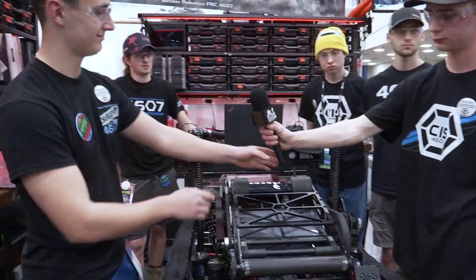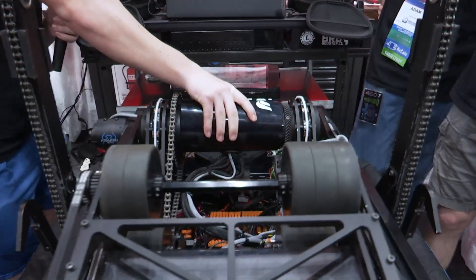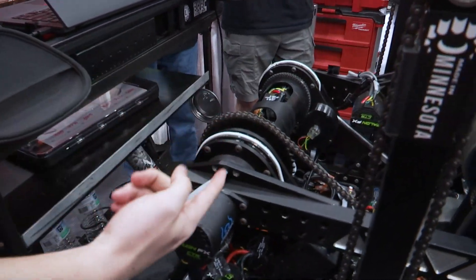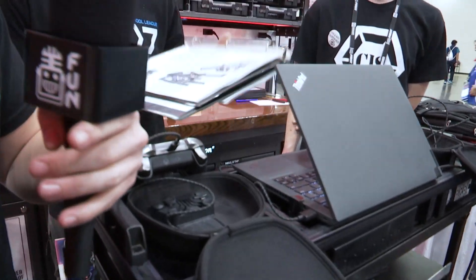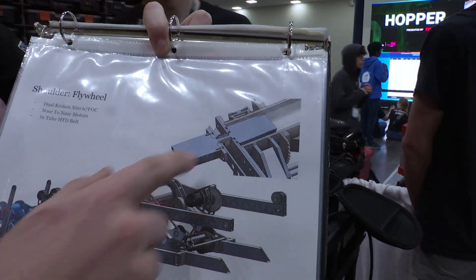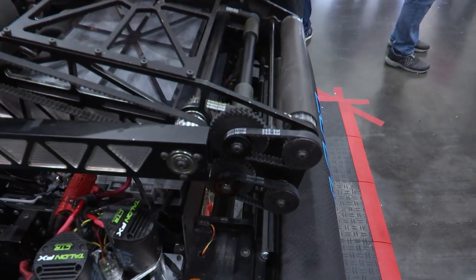About getting up to that shot — this is our shoulder pipe, and in here we actually have two Krakens. We call this the kissing Kraken side: one Kraken here and another Kraken actually inside the pipe. We shave them to about half-inch shaft length and they're kissing on a pinion, with a pulley pressed around it. Then there's a belt around that pulley that goes all the way up to what we call the cake stack.